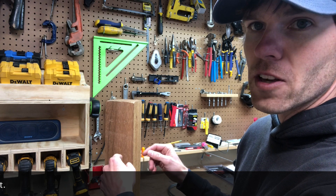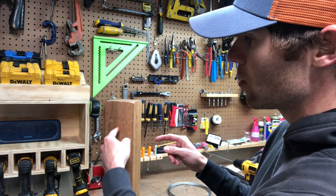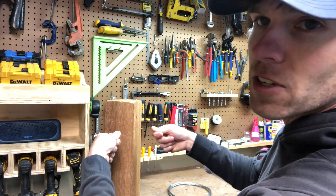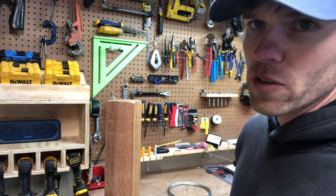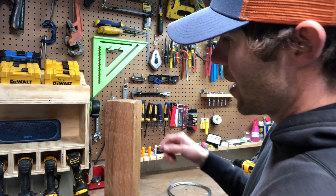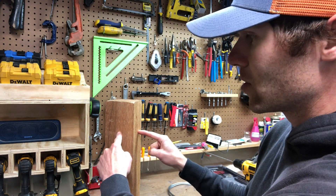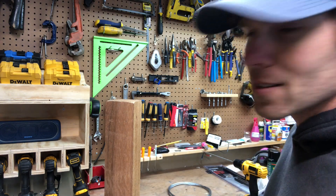The main question I had was how I did the corner post. If you watch the video, a couple minutes in, the corner post had my cable going in one side and out the other so I didn't have to have actual fasteners on each side. A few people thought I did a 90-degree corner in there, but I did not — I did a 45-degree angle through the post, basically drilling a hole from one side to the other.